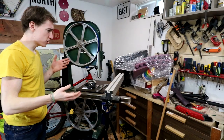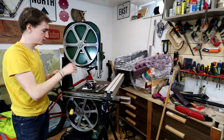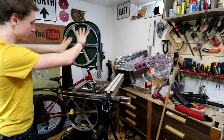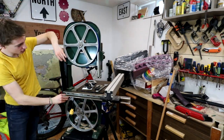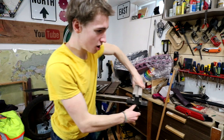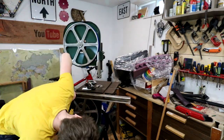The first thing you're going to need to do — and I've already done this — is take off the panels, however they're attached to your bandsaw. For mine it is four of these little thumb screws. You need to get access to this wheel and this wheel. You also will need to take off any guards like this one right here on the side, and any fences like this one that I have here — those can come off.